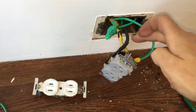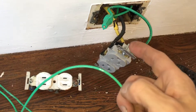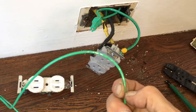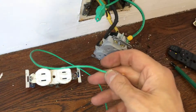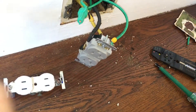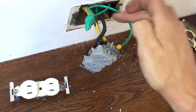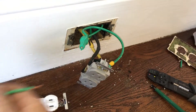I brought it together so I didn't disturb any of the wiring in the house - I added a little extra protection. What I did notice is that the original wiring is actually 14 gauge underneath all that insulation - it wasn't 12 gauge as I thought it would be. That is unusual for my San Francisco houses; I've owned houses built back in 1917. They have a 20 amp circuit breaker - somebody replaced the panel downstairs - and they have a 20 amp circuit breaker on 14 gauge wire.